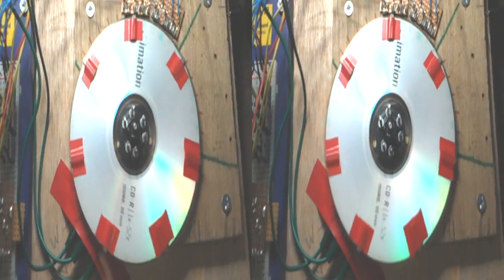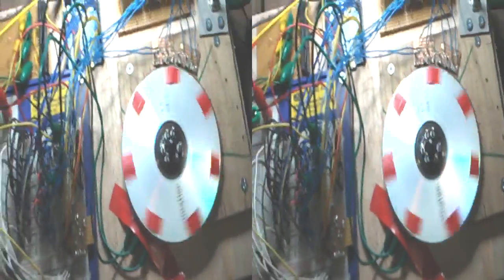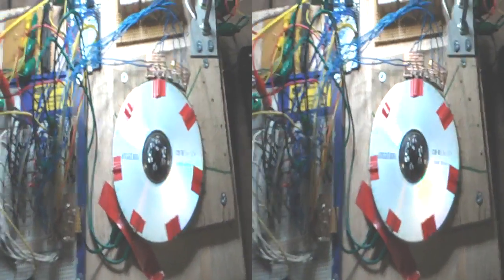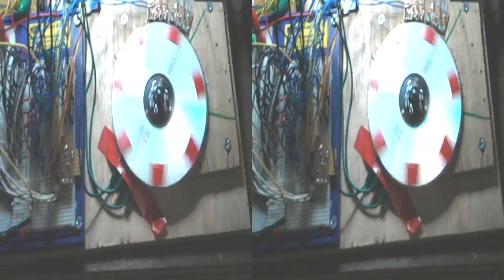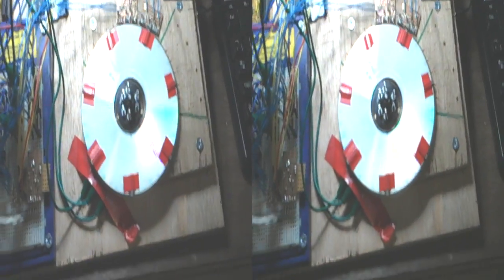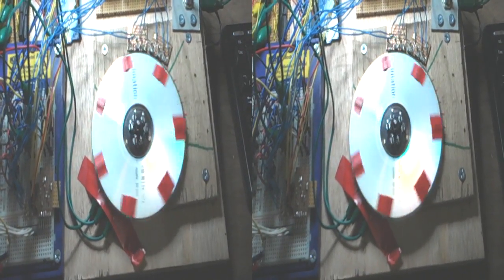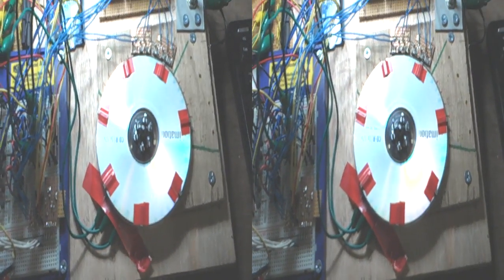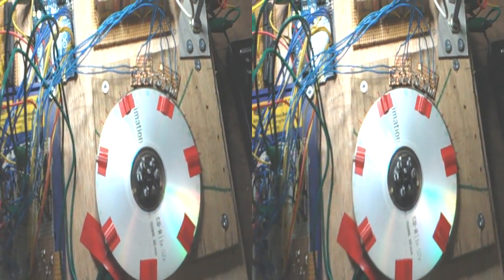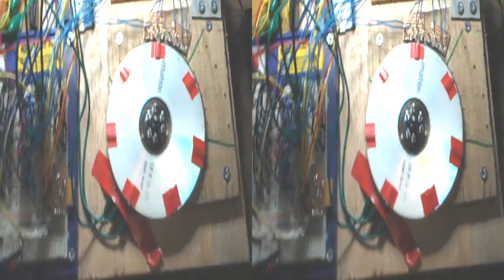And in terms of a shoot-through, yes, it is possible for the software to glitch and do a shoot-through. But I'm going to wire the electronics so that it wouldn't allow that to happen, so you wouldn't get a glitch going through to the electronics. Any software glitches which cause shoot-throughs, and I don't know if there are any, and I don't think it is the case, it's not locking in two places at the same time, it seems. Any software glitches would be removed by the electronics, so we can't have a shoot-through. The worst thing that could possibly happen is that it attempts to simply lock the field, which wouldn't cause problems with the IGBTs, but it might cause mechanical issues.